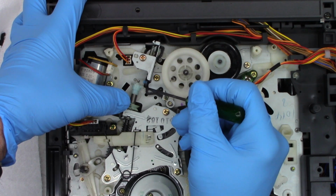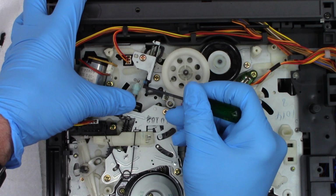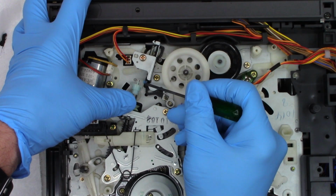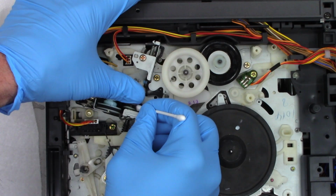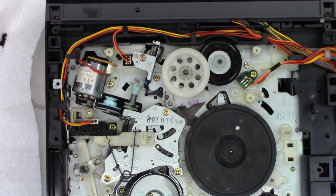And then when it gets to the end of the tape, these things come around and it does not allow it to slip in this direction, only in that direction. So when this lever comes out, it loads up to where it needs to be. When it gets to the end of the tape, this comes along and it slaps that little lever right there, pushes it down, and it immediately engages the brakes to stop the tape, because this thing's hauling butt at a pretty good clip, and you don't have a lot of time to react. When it gets to the end of the tape, it needs to stop immediately, and the loading motor really doesn't have enough time to physically move to a different location. So it uses, like I said, a wrap spring clutch. It only allows it to move in one direction.